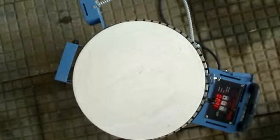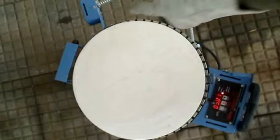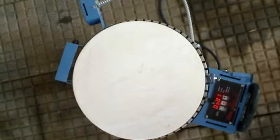This blue box that's on the back of the kiln is the switch that triggers the power. So when that lid is lifted, the power is cut to the inside of the kiln. And that's real important with this process, because when you're reaching in with metal tongs, if you were to come into contact with the elements, you might get zapped from that. So it's important. It's an option to have added onto the kiln, but I strongly suggest that little bit of extra money to make sure that you're safe.